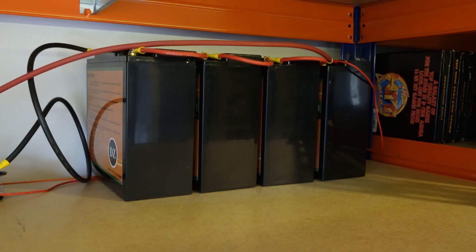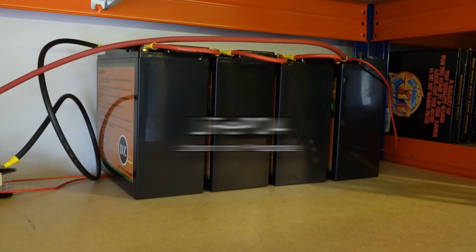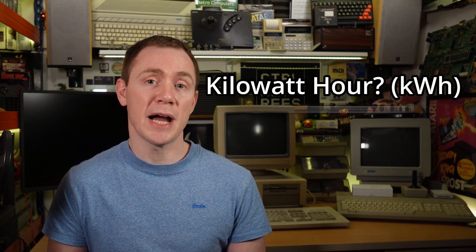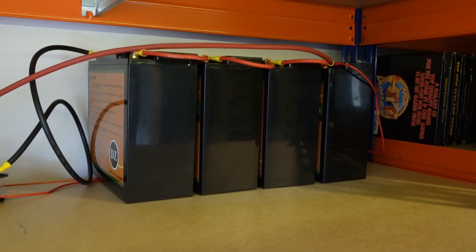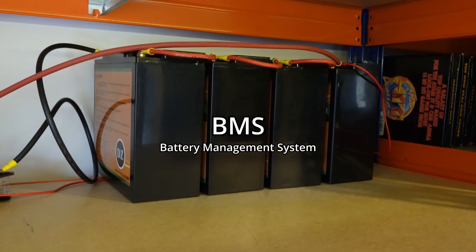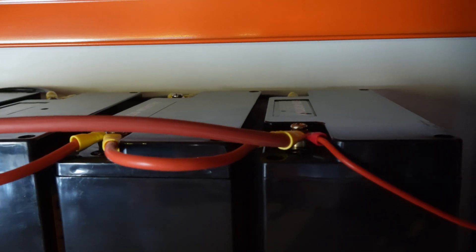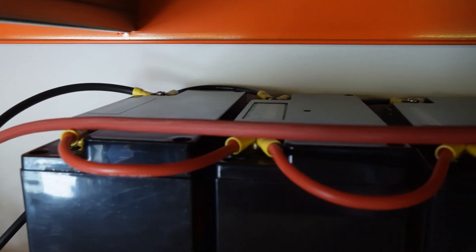The charge controller is connected to this bank of 20Ah LiFePO4 batteries, which is a modern lithium chemistry that is very compact, safe and efficient. There are four of them connected in parallel for a total of 80Ah, which is exactly 1kWh of capacity at their nominal voltage of 12.8V. Basically, if you hook something up that draws 1kW of power, these batteries will be able to power it for an hour — as long as everything's 100% efficient, which is pretty much a physical impossibility, but it's close enough as a general rule of thumb. These batteries also have a built-in battery management system, or BMS, which keeps the lithium cells in good condition by managing charge and discharge rates and keeping everything balanced. Generally you shouldn't connect batteries with their own BMS in parallel, but according to the manuals everything I have here is configured correctly — I've double and triple checked, because I really don't want to burn my house down.